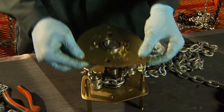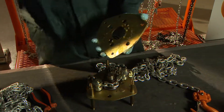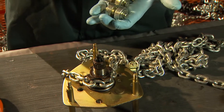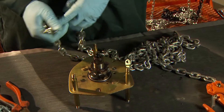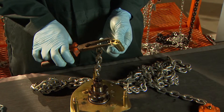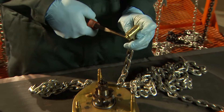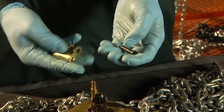Separate the side plate assembly. The guide rollers, chain stripper, and load chain are set aside. Remove the split pin from the chain anchor pin. The chain anchor pin can now be detached from the chain anchor plate.